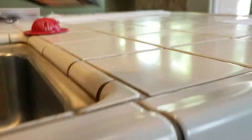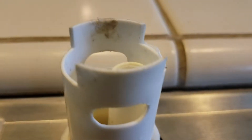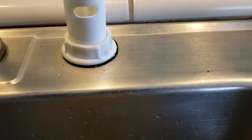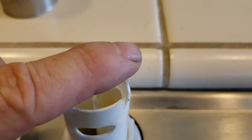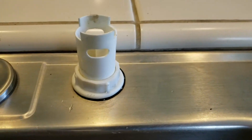There's only one part missing up here. We would have just replaced the air gap, but we didn't have one in our bucket. The only thing missing is the cap at the top — a little plastic piece that pops into place, snaps into those two large slots with a little retainer, drops in and snaps in place. What it does is divert the water down. The functionality is: water comes out of the small hole on the right, hits the bottom of the white cap as a diverter, and goes down the larger hole into the 7/8" hose. Since that cap is missing, if you ever have trouble with water pressure it could blow this off. Just buy a new air gap, pop the top piece out, put it in here, throw the rest away, and you're good. You do not need to remove the existing assembly.